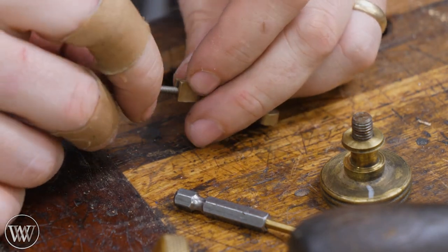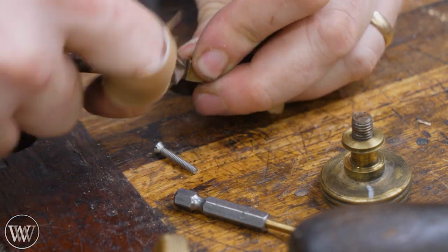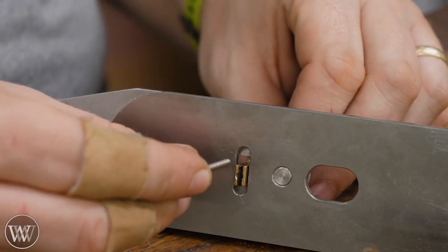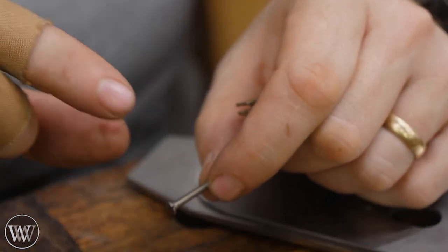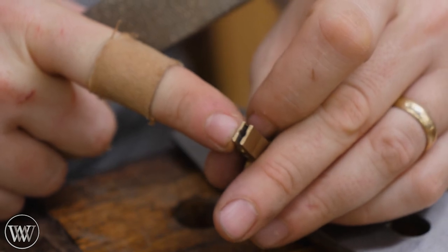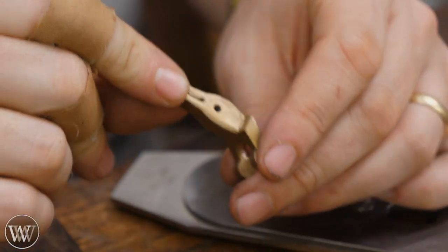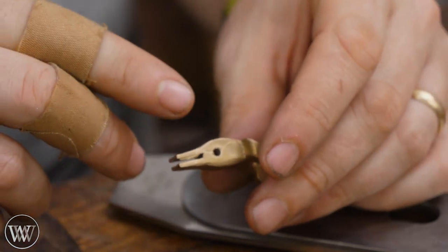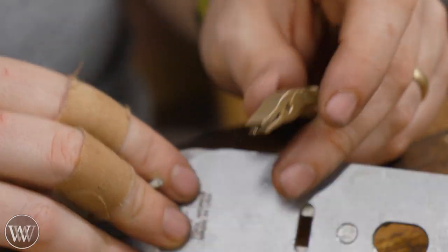Most of the time I can just grab the screw and drive it down in there, but sometimes you need a little countersink and you can ream it out just a little bit to start the threads and make it easier to run the screw down. With everything in place, drive the screw into the slot until you have a good tight fit. The problem then is the screw sticking out, so come in with diagonal cutters or wire cutters and snip it off, then come in with a file and clean the tip flush — or just a little proud so the lever cap doesn't run into it. The split yoke is much easier to install, though it doesn't give quite as much workability as the file-to-fit.